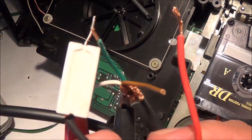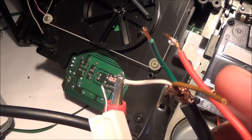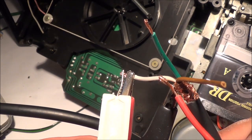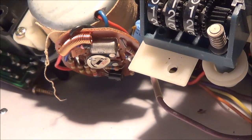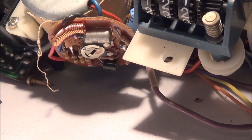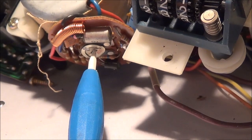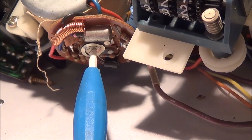The last thing I'm going to do is hook up this resistor - I think it's an 8 ohm resistor. One lead is going to go to the ground side and the other lead is going to be hooked up in parallel with one of these channels, left or right. The adjustment for this motor is actually right here. All I'm going to do is make my adjustment here and bring it down to 3000 Hertz - this is a 3000 Hertz tape.